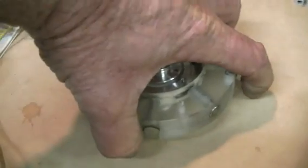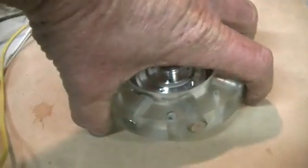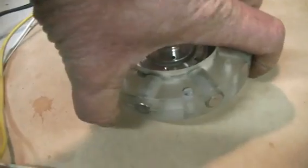All we're going to do now is stop the rotor and remove it — nothing else in the system is going to change, everything will remain the same. We're only removing the rotor with our magnets in it. So once again, that is our waveform with our rotor and magnets: our voltage across our 100 ohm resistor on the flyback output and our current going into the system. Let's stop that rotor. The system is running; I can feel it pulling on that rotor — the rotor doesn't want to come off, tight bearings.